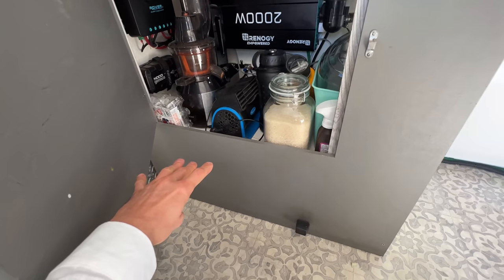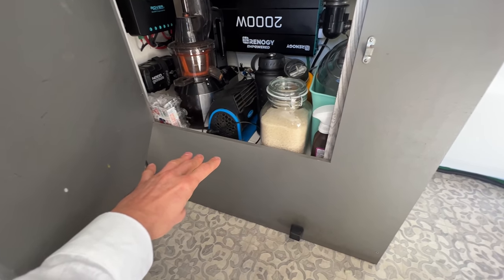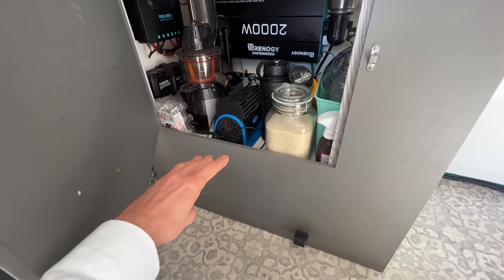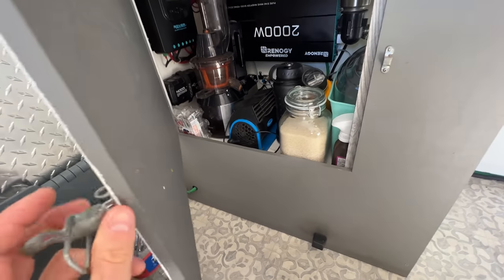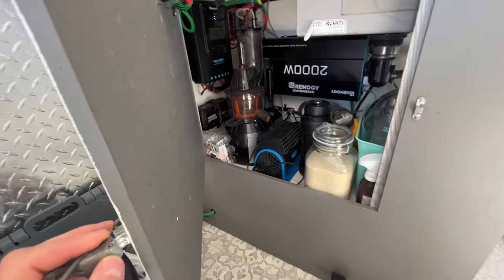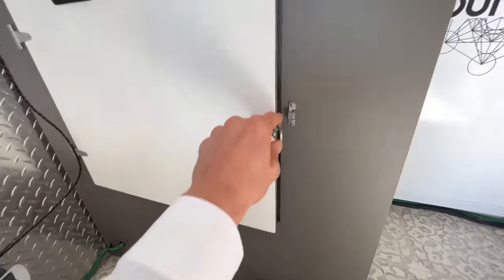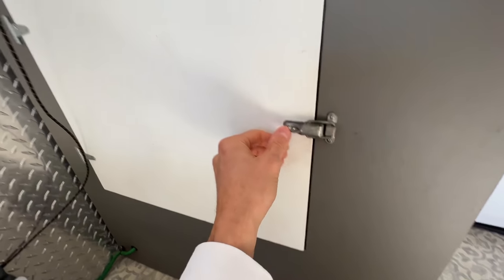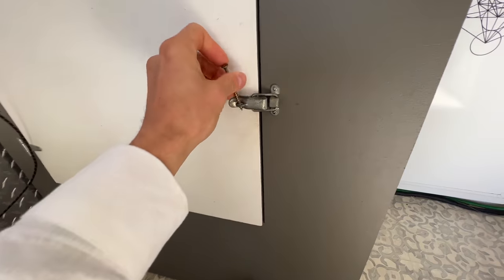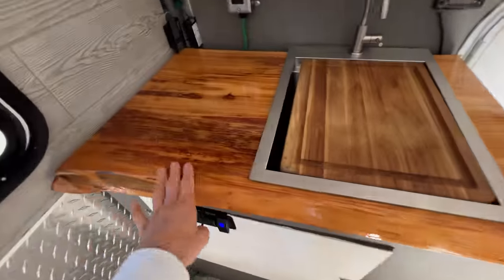I have all my wiring in the back, safety cutoff switches, and fuses up top — everything's got its place. The batteries are underneath: I built a little shelf, and under it I have two 200 amp-hour Renogy AGM batteries — 400 amp-hours total, but because they're AGM I can use about half, so roughly 200 usable amp-hours. As long as I get sun, I can go about a day and a half without recharging, so you do have to chase the sun a bit.